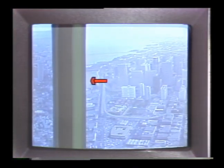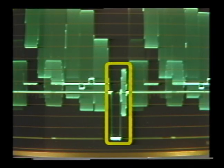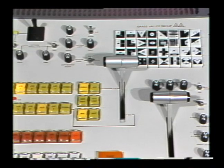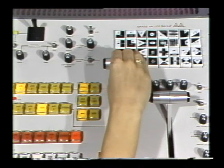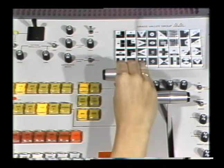The timing information on a picture monitor is here, off to the side of the image we see. On the waveform monitor it's here, and it's called the horizontal blanking interval. Whenever you combine one source of video with another, both must be timed together or the picture will jump during switching — watch this.